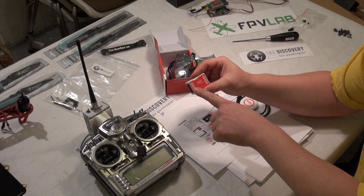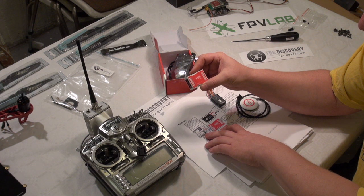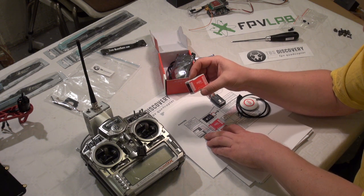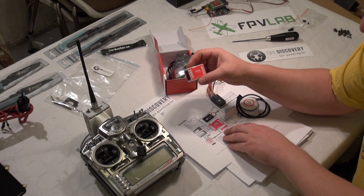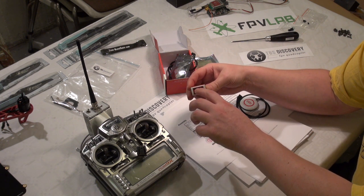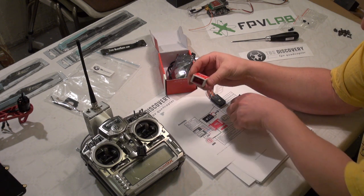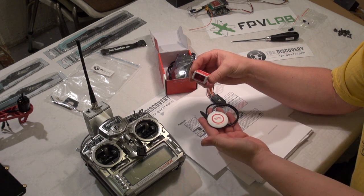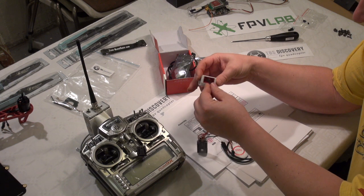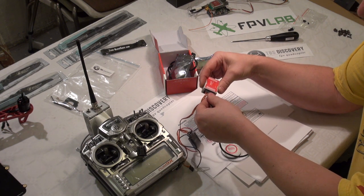U is used for a two or three position switch channel — that's where we're going to switch between the different modes. And we have a LED port; it says LED and it's the one in the upper part. And we have the expansion port routed to the Naza GPS. The LED should go into the LED port, and GPS to the expansion port.